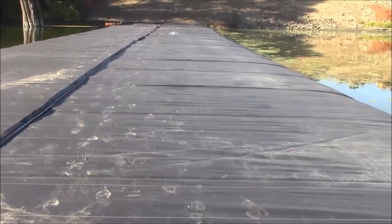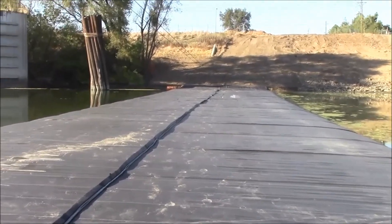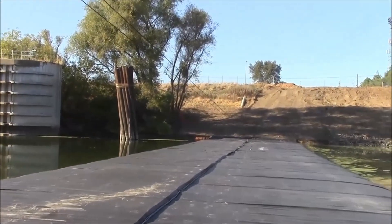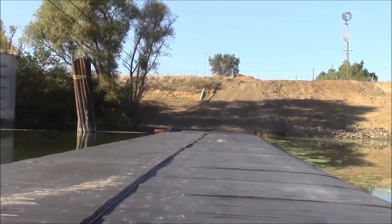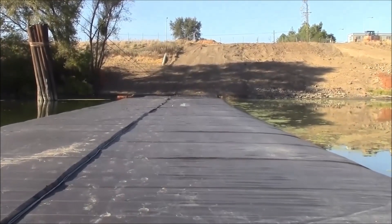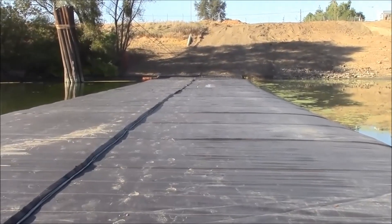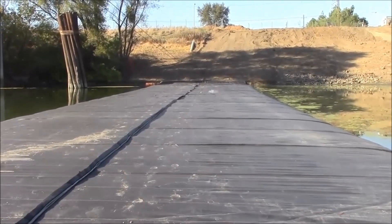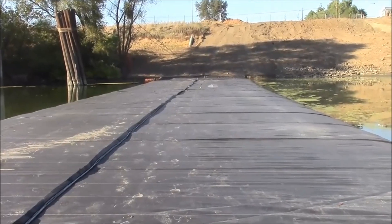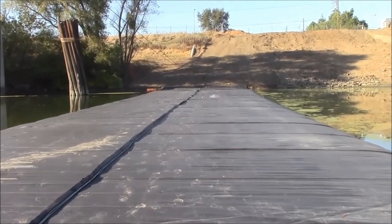We have continued pumping water into the aqua dam. The two ropes which were restraining it are now cable tight and we will continue to build head in the aqua dam until the ropes break, at which point the aqua dam will rush forward, roll up against the bank and isolate the work area. We only want to do this once the work area is at high tide levels.